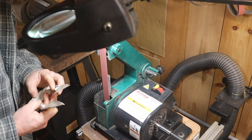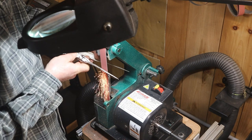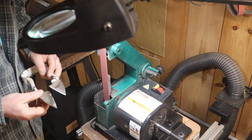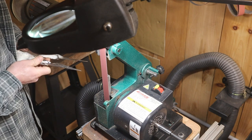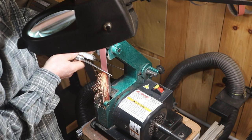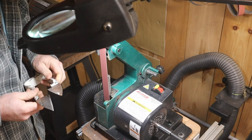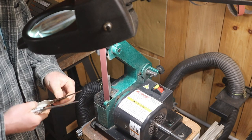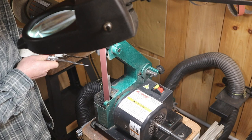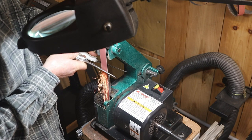The first one has put up a burr nicely. Same process on number two — watching the burr on the back side. I've also used a wire wheel to push the burr from the flat side back to the bevel. This second pair ended up being a problem. It did put up a burr, but the issue we're going to find out is that the back side of these has been worked. The back side has a bevel on it, so even though it's putting up a burr, when you close them, the edges don't actually touch.